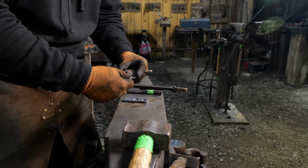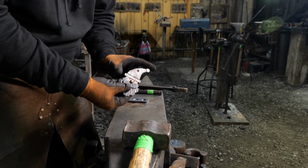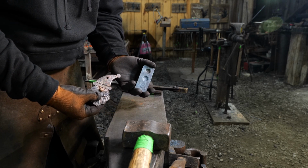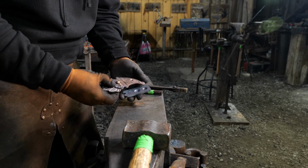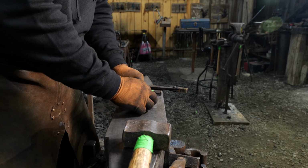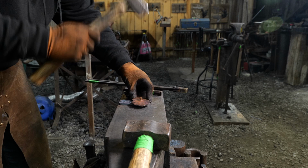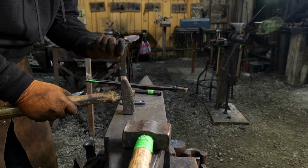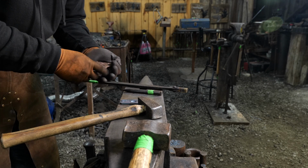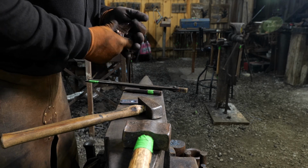From there, we're going to mark out the hole location for the nose with a center punch mark. That will be drilled. This is a 1/4 inch rivet by 3/4 inch long. The 3/4 inch length is just a hair big, but it's what I could get in copper. Later on I may be able to find a 1/2 inch long one, which is about the right length you need for this. So 3/4 is just a touch long, and you may want to file that rivet down a little bit before you actually rivet this guy up.